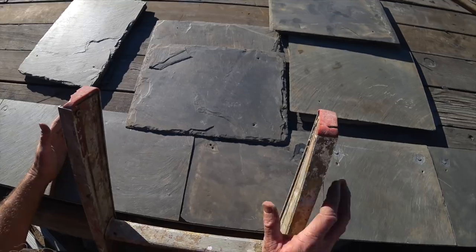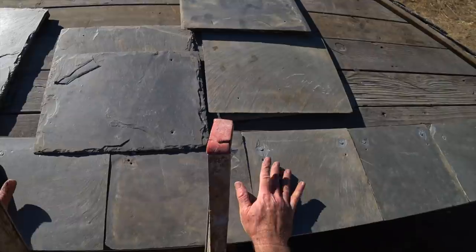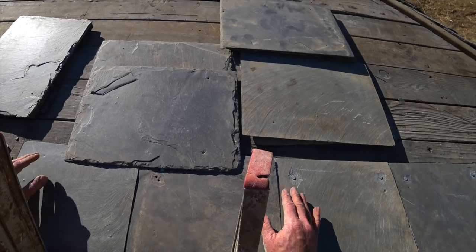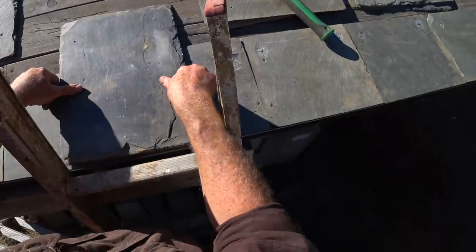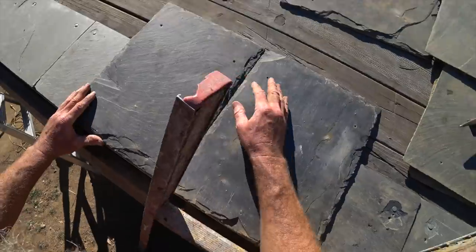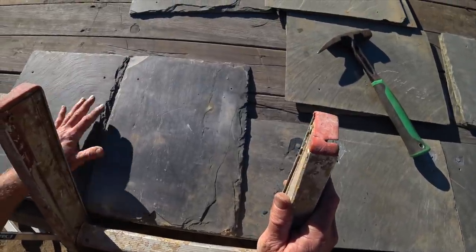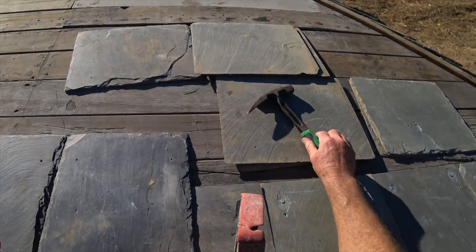I'm going to start with the thickest slates in the middle and get thinner towards the outsides. I have a lot of different thicknesses of slates and you can't just mix them up. If I'm going to put the thicker ones anywhere I'd rather they were in the center of the roof - just for looks. I do want to be careful when laying these not to put like four black ones in a row - most of the slates are more of a greenish or bluish color.